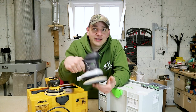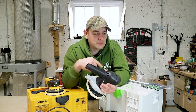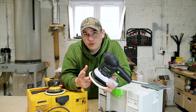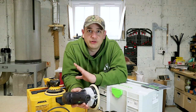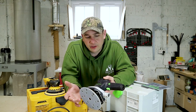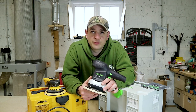It has the Festool power cord so you can take that out and swap it between your other Festool gear. Dust extraction is amazing on it — especially when connected up to our Festool MIDI. It's 310 watts, so it's not as powerful as the Mirka, but with that additional weight, it doesn't really matter. I think they're for different applications. If you're going to be refinishing old scaffold boards, outdoor furniture, doing big jobs like that — this is probably the tool for you. Because of that additional weight, it's great for stock removal and finish removal.